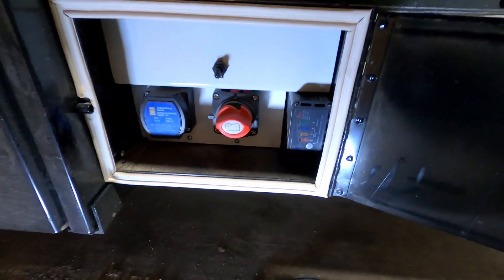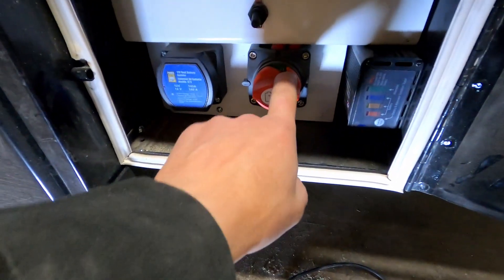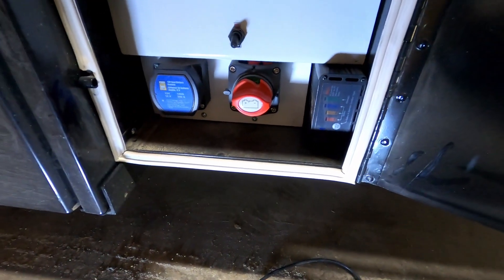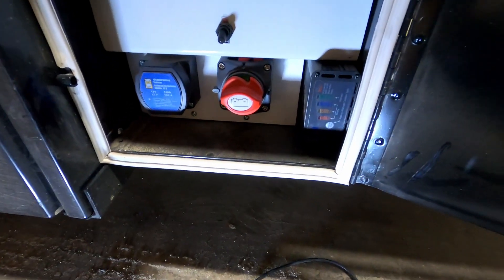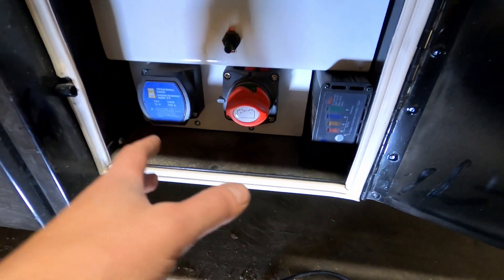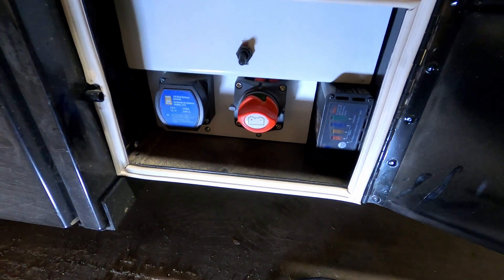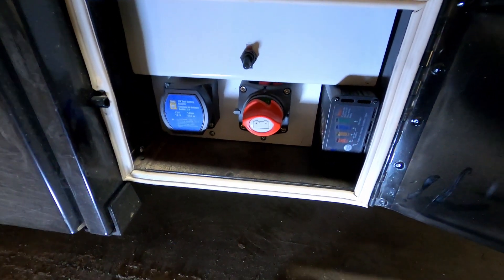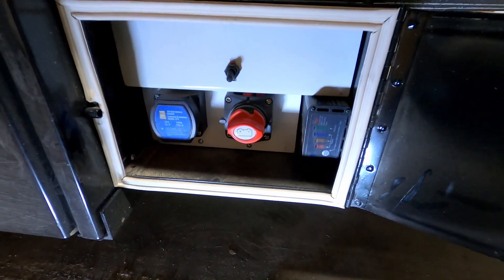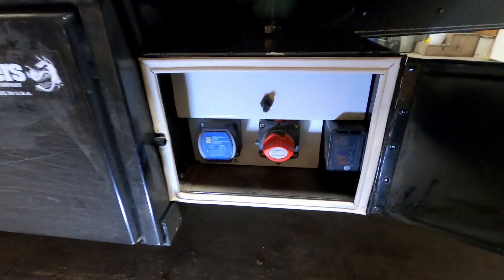If you don't have that unit, you can use a regular battery charger when your batteries are low — just run to the battery, plug them in, good to go. This is also a safety disconnect I've added because electrical fires can happen. You can turn it off, and it completely disconnects your batteries from the unit so whatever charge you've got stays there. In super cold weather, if you're not going to be using your easy loader for a week or two, turn that off to save your batteries. The downside is you do want to turn it back on to recharge your remote batteries prior to use — otherwise you'll get to the field with dead batteries in your remote. But you saw the spare batteries in the cabinet; that's kind of what those are for.